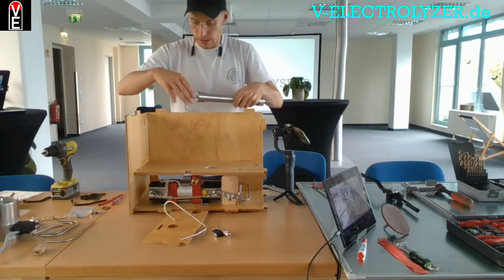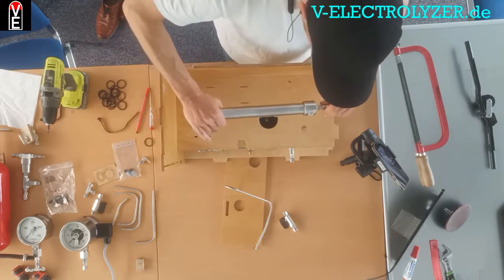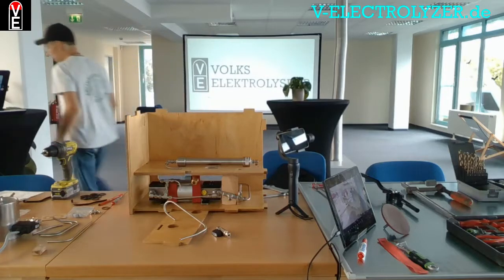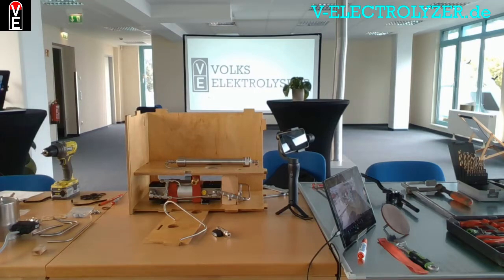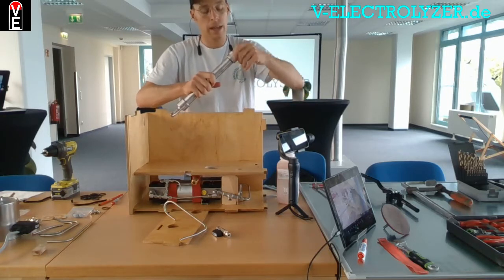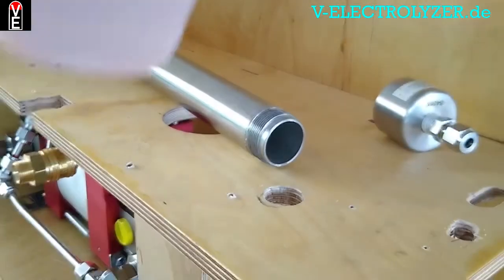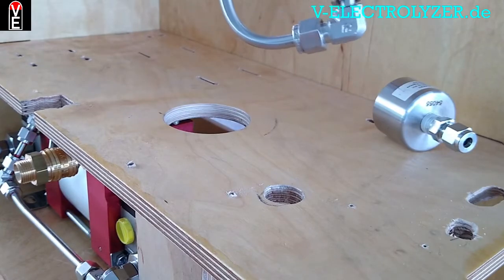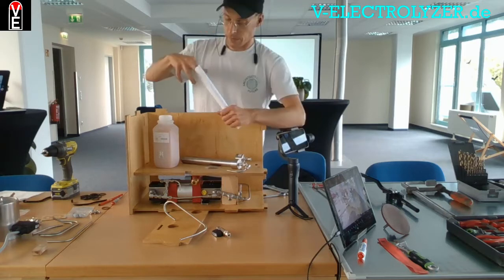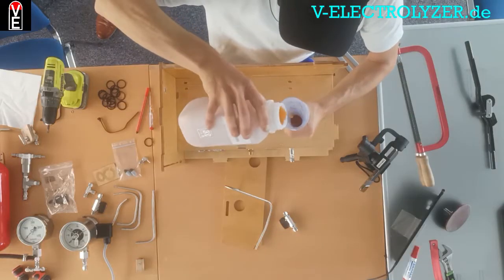Get hold of this first drying unit. We have to fill it with silica gel, which changes color depending on its saturation. When it is full, you just bake out the pearls — they change color again. It's called an absorber column. I made myself this helpful tool to fill it in.